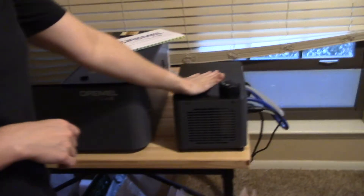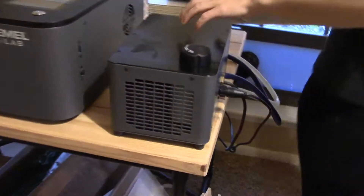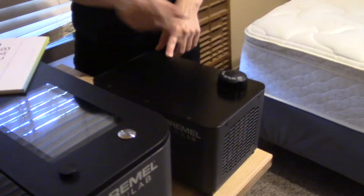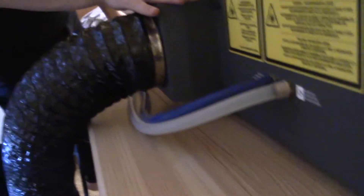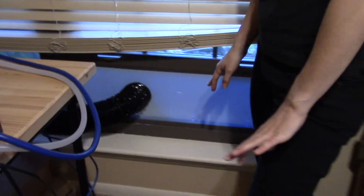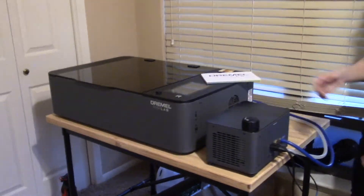The hex box here does water cooling to make sure the laser doesn't get too hot — you put water into this part and it pumps back and forth through these tubes into the laser cutter itself. The last part is the ventilation; right now we're just using the onboard fan with an insulation foam setup. This is temporary until we have a permanent hole going outside and we'll be using the booster fan they'll be sending soon.